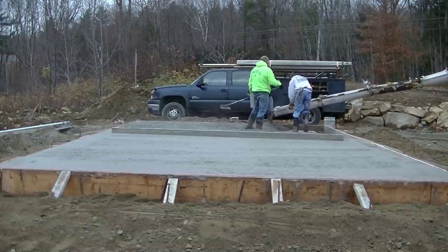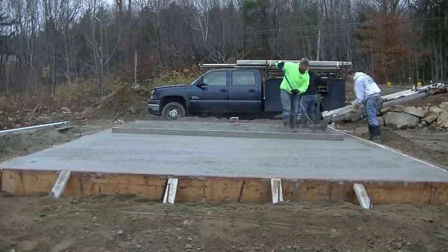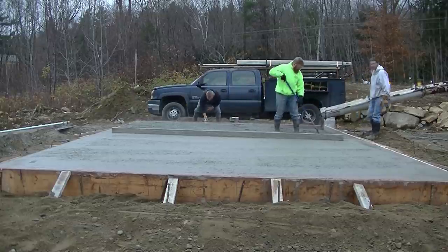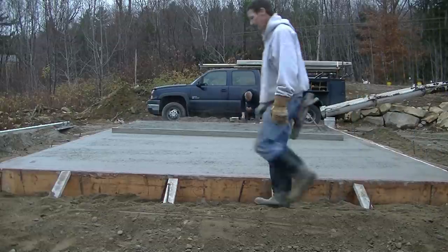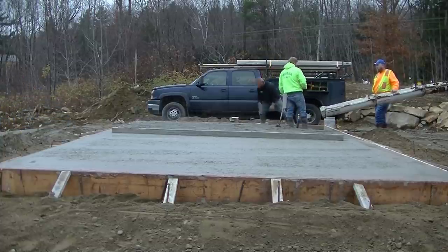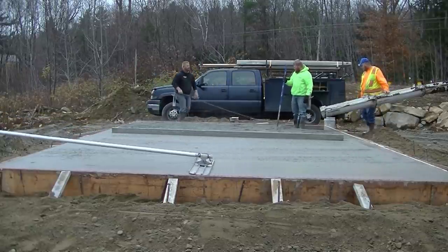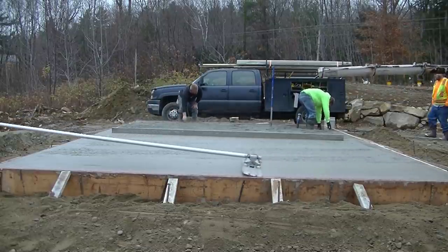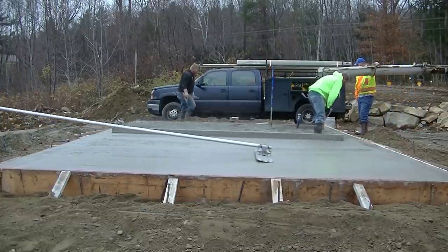We're pouring out and going to get just about the rest of that piece poured, leaving a little bit open at the end just in case we're high, so we don't make a mess on the outside. Luke's putting that last piece of rebar in, and then I'm going to stop bull floating. The bull float pushes down the rocks and aggregate and brings up the paste to smooth the surface. When we go to finish this we're going to power trowel it — the bull float just makes the power trowel a lot easier.